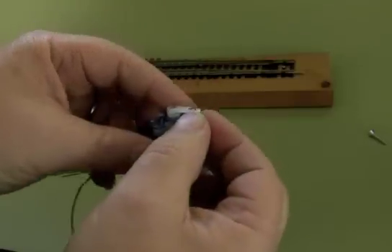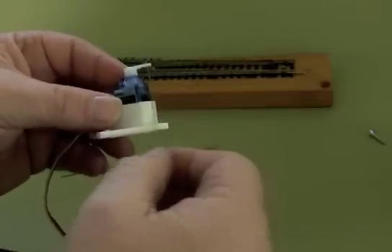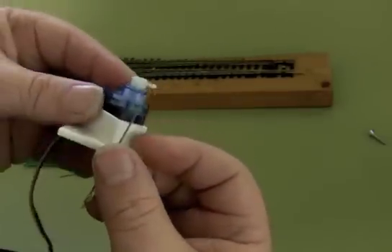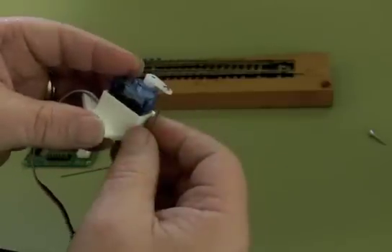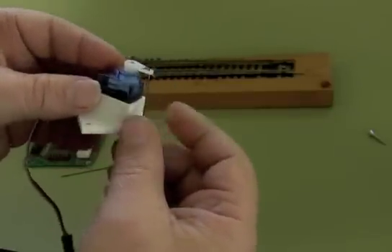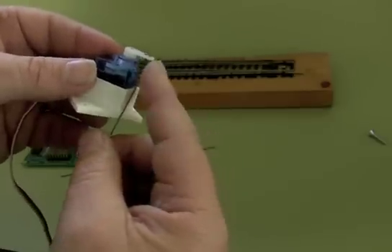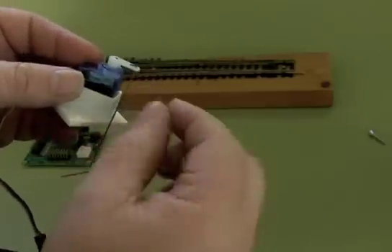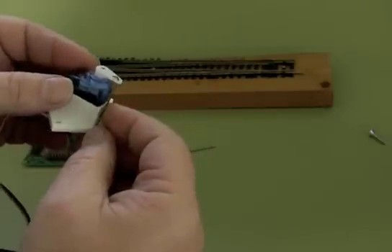The hardest part is actually bending this wire and getting it connected to the servo horn here. There are other ways you can mount wires to servo horns — all sorts of clever things made with screw connectors. But over the years I've discovered that bending a wire is really the best and safest thing to do. This will hold forever and will never come off. Whereas if you use a set screw, eventually it works out and comes apart and you have to redo it.